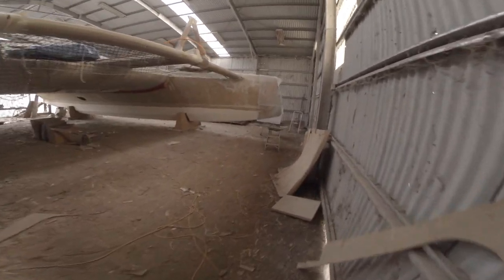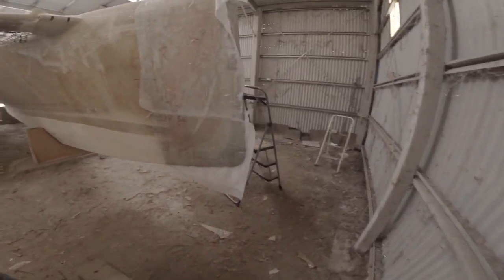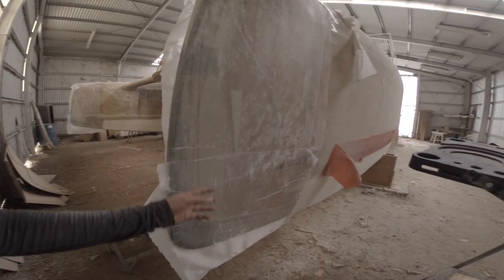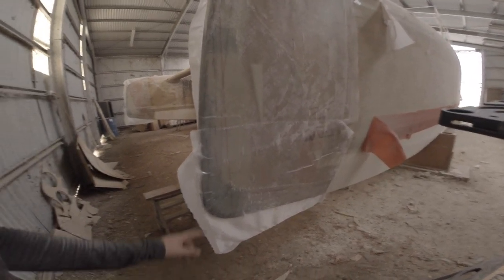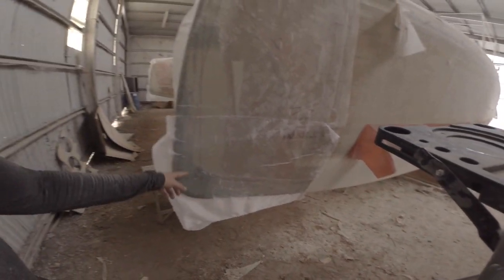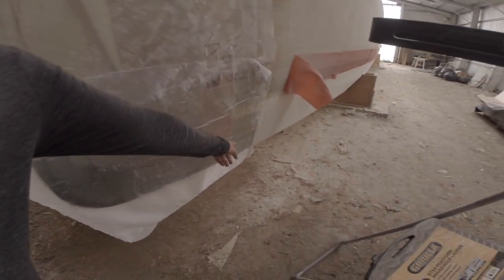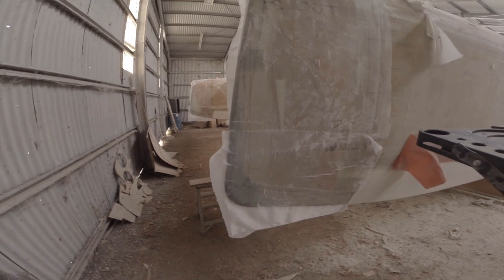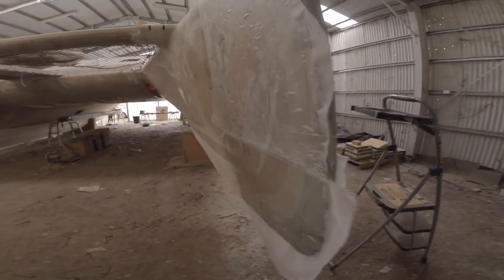We just put the last pieces of glass on the bows. There's a hell of a lot of glass here now. They're overlapping layers. So on each side, there's four layers of glass, plus an additional layer around the front end, and more at the waterline. So this was very sturdy with just the one layer of glass. Now it's rock solid. It won't be going anywhere.